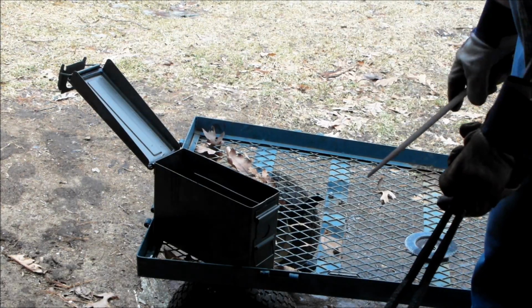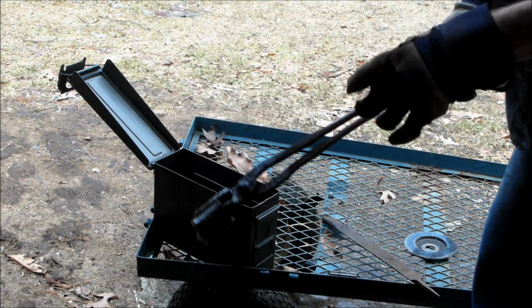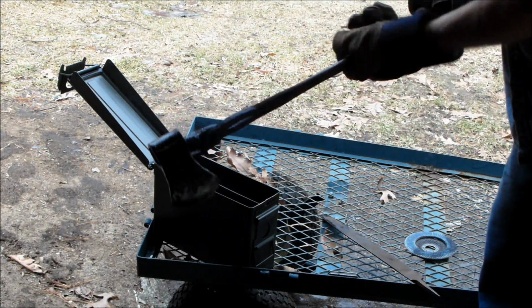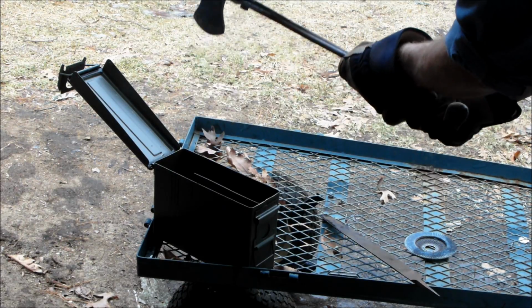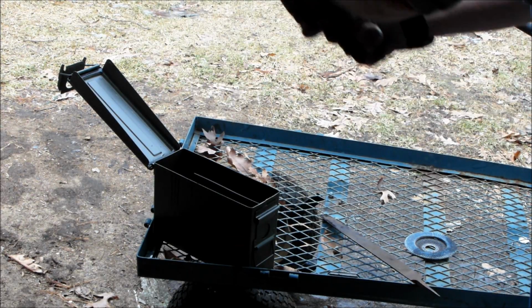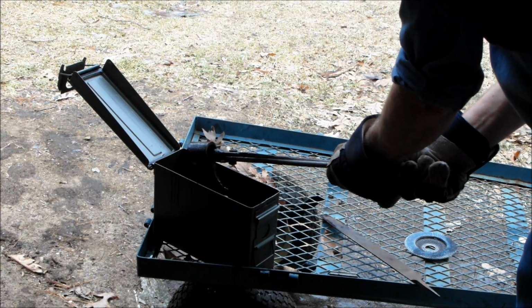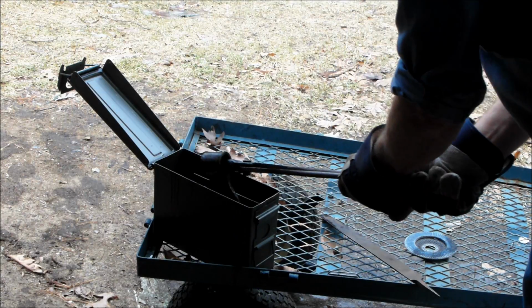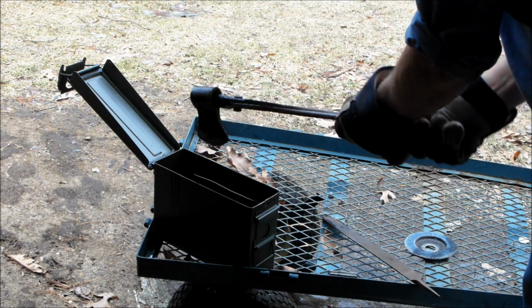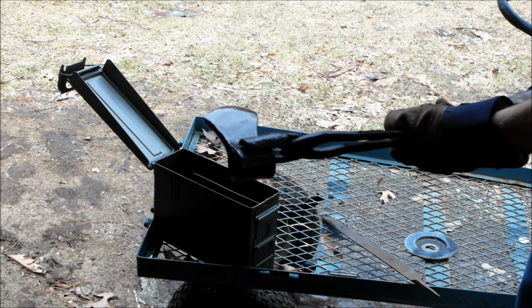I see no warps. You know, I guess what they say to do, probably has to do with the rotation of the earth, but they like you to go north and south on your oil. See how that blade is? That's north out there. North and south. You don't ever want to, when you're quenching it, move it around. Or I don't know about this north or south thing, but I did it just because. So we'll see how that goes.